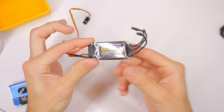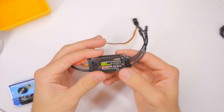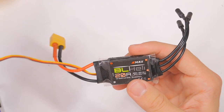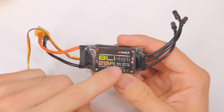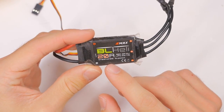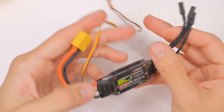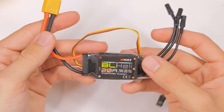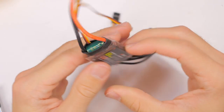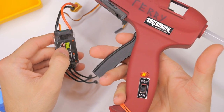I also realized that the rubber heat shrink tubing that comes on a single ESC is already the best, most water-resistant material you could ask for — it's like a solid piece of rubber that goes all the way around the ESC. As long as you can seal up the ends, you wouldn't even need to apply any kind of waterproof coating to the actual circuit board. All you would really need is something like a silicone sealant, and hot glue is a type of silicone that can work just like a sealant.